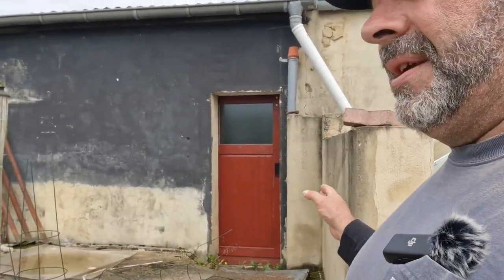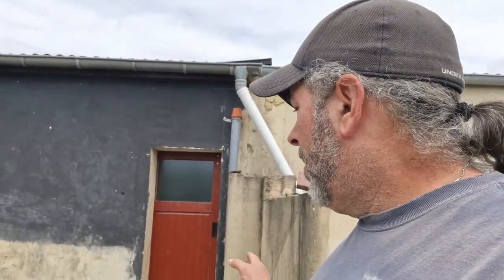So that we have that room just in case it is off a little bit wonky. The only thing I am going to do, on this end here, on this run coming out, is just not pour a ring wall, but make it where the mortar, I'm going to mix up the cement and basically lay it in mortar, because the door is going to be over here. And what I don't want is a wide area where the door threshold is.